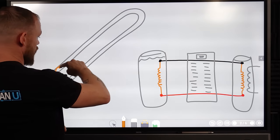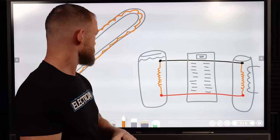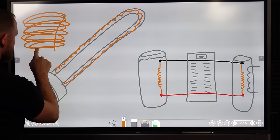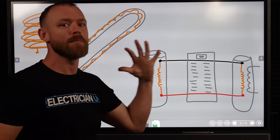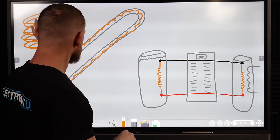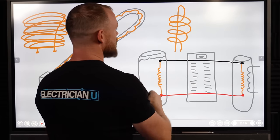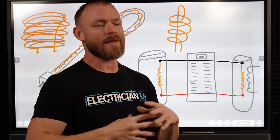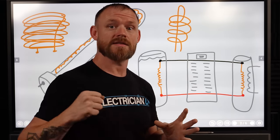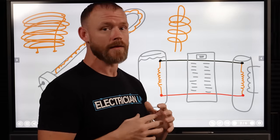Another way is it could actually be a coil of wire, just like a light filament would be. And running current through it is going to heat it up. There's a bunch of different shapes too. You might have something shaped like this, really fat, and it's got two terminals, and if there's water pumping through something and they want to heat water up as it's passing by that thing in a huge pressurized system, they may use something like this, or there might be some weird coily thing that goes like this. And then it's got a middle section, and there's a ton of different ways that elements can be, like a toaster, but essentially you're just cramming current through something with a certain amount of resistance, and based off that resistance and the amount of pressure that you're applying with voltage, it's going to run current through there and it's going to make it glow and start getting really, really hot, and it'll heat up anything that's around it.